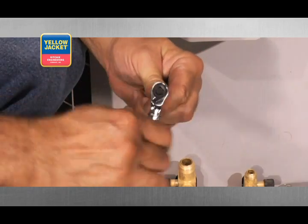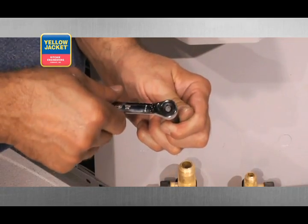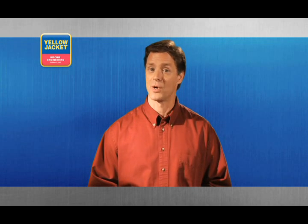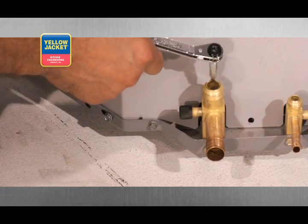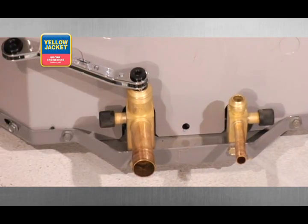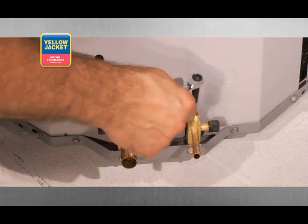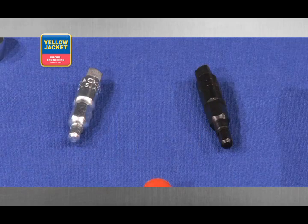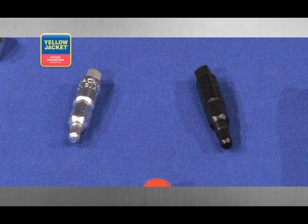It comes with a dedicated direction of rotation, so you don't have to worry about the reversal mechanism wearing out. There are heavy duty versions of this wrench available, as well as wrenches that ratchet in both directions. The knuckle saver is another version of the ratchet wrench, engineered with an offset to help get your knuckles away from obstructions. One of the key accessories for the 1/4 inch ratchet wrench is a hex key adapter, used to open and close high and low side service valves with deeply recessed safety sockets. Different size hex keys are available for specific HVAC&R branded equipment.